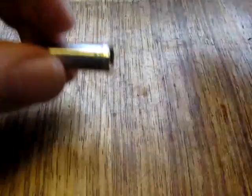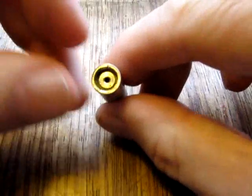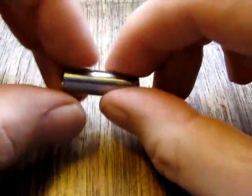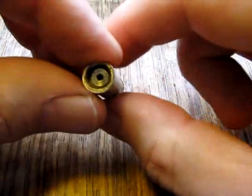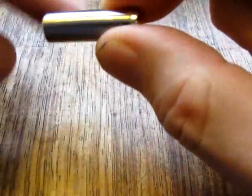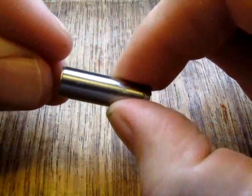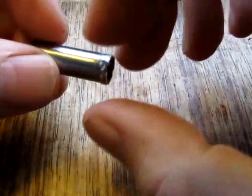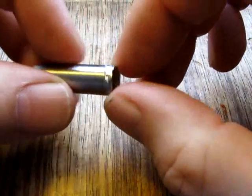So what you have here is the two connectors, one from the Titan battery, one from a super battery, and inside there the two terminals are connected by two wires. The super battery, because the casing is from a super battery, the super battery connector fitted very firmly into there. I just needed to push it in once I'd soldered the two together. And obviously don't forget to thread the wires through the casing before you solder the other connector on.